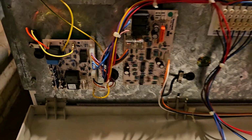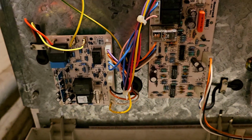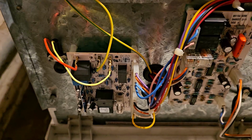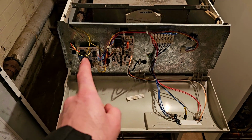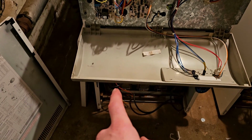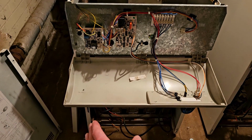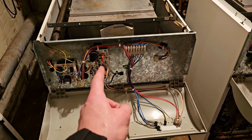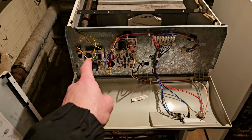So the first thing I do in this situation is I assume I've done something wrong here. Yeah, so I'm looking at my wiring. I've got orange, earth, yellow with one spade connector unused, and here we have orange, earth, yellow. So it is exactly the same. The boiler's still doing the same thing. I'm going to put the old board back in quickly. If not, it's either the coil on the gas valve is shorting to earth and drawing the power down, or something along those lines, so I can check that, or it's that board there. They're the two things I think it could be, the gas valve or that board. But first thing I'll do is change that board.